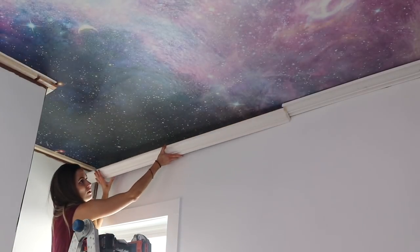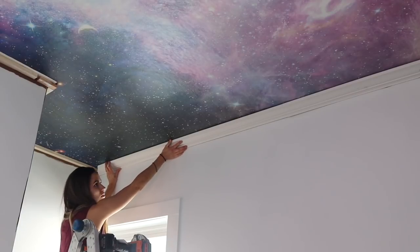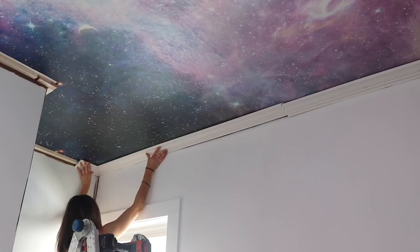During install, I started in one corner and then worked my way around the room in the same direction, making my outside corner the very last pieces to cut. I strategically did this to allow forgiveness in material if I made a bad cut, which there were plenty, but this also allowed me to continually use one piece when checking my corner fits.